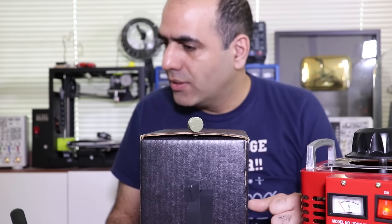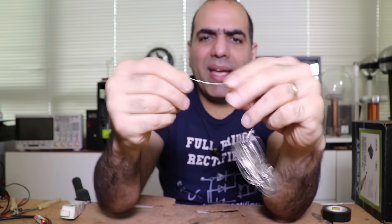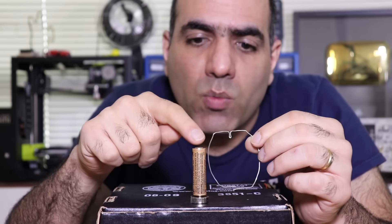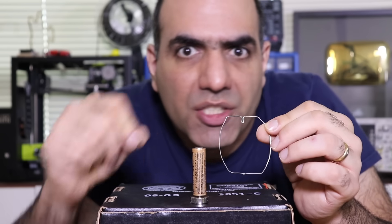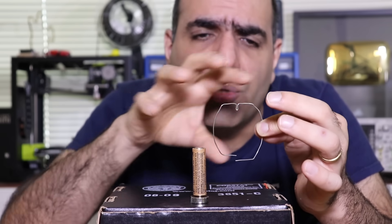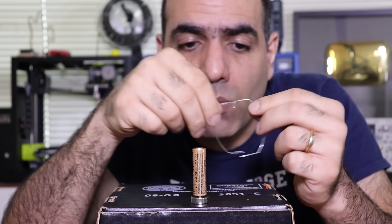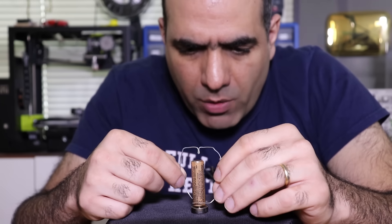Let's just make it with the battery and see what happens. I have a strong neodymium magnet and I stick an AA battery on top of it. Then I bend some wires to make a shape like this. One side of the wire touches one side of the battery and the other side touches the magnet, which touches the other side of the battery. So this will short the battery, and depending on the type of battery it could result in a couple of amps through the wire. This will create decent magnetic fields around the wires and kill your battery in a jiffy. Let's see if it works.